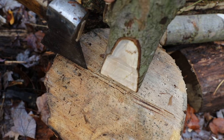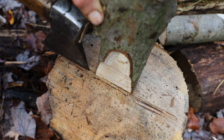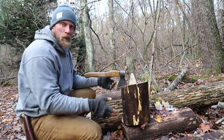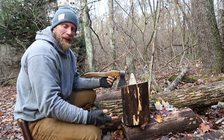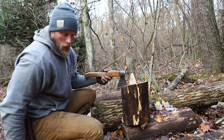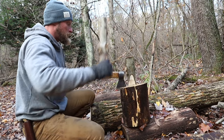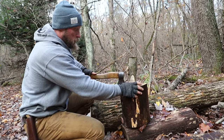As these checks start to open up, we're going to start to put our wooden wedge in place. This is going to take a little bit of patience and muscle to get that started. I found another log and placed it underneath as an anvil since the ground is muddy — so as I apply force it won't drive the big log into the ground. Take the baton and work this big wooden glut down inside. As I do that I'm also going to work my axe in a little bit further, which should open up the score line more and more.